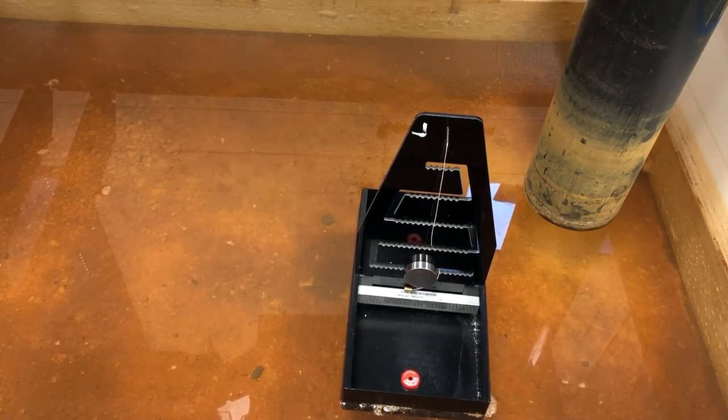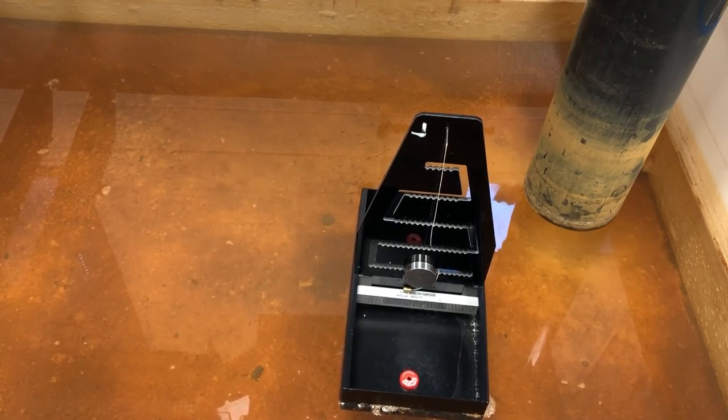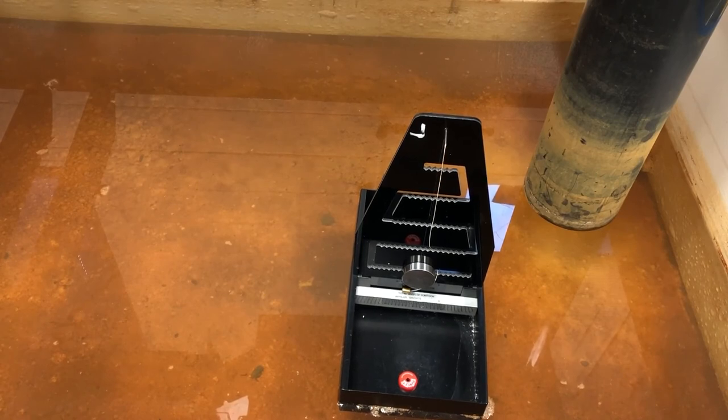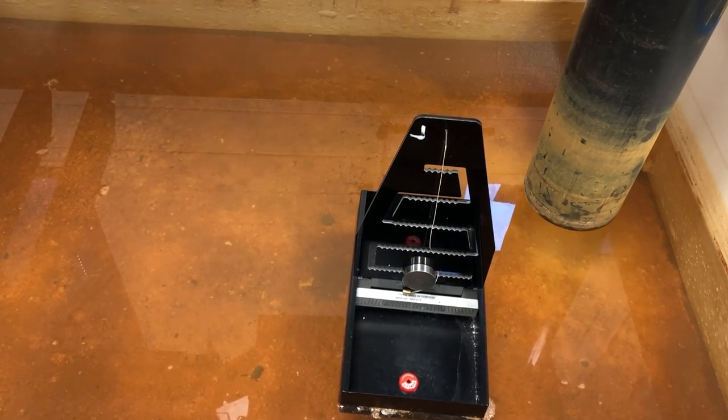Many yachts are not very large, and the way in which they roll is determined by their metacentric height. Some yachts tend to roll over and come back very violently — that's very hard to take. It's not much easier on the other extreme, where they roll over very far very smoothly — that's not very fun either. I've experienced both in years on the water. So with that in mind, we're going to use the roll time check. Like I said, this is not the most precise thing, but we're going to do this three times.